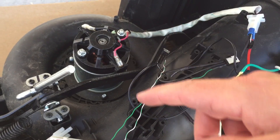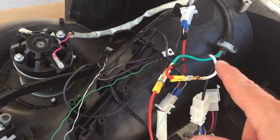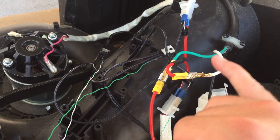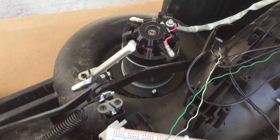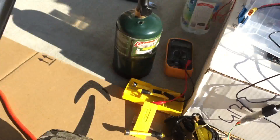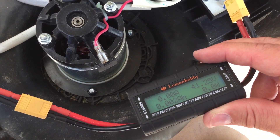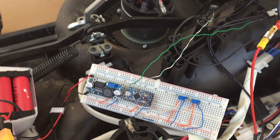Right into a couple of MOSFETs here and here — they're switching on the low side. And here's the mower switch up there. That guy needs some shrink wrap on it, but it's switching on/off on the high side while controlling on the low side. I set it to about 27 volts for each motor, pulling these off separately with the meter. This is what we ended up with: two amps, 84 watts — not a lot, kind of weak.